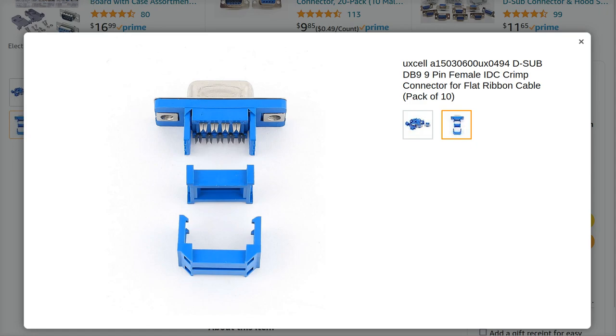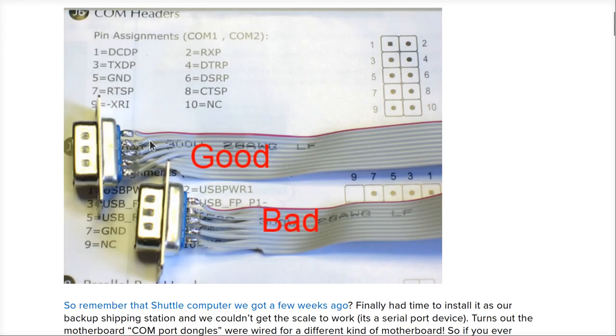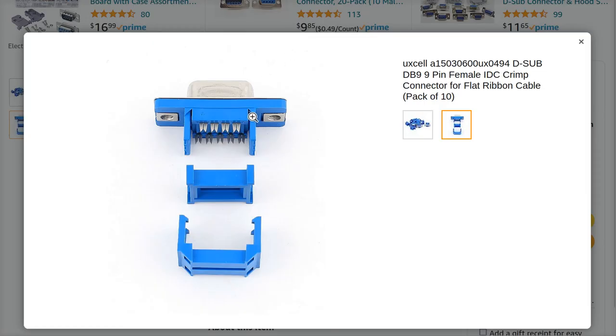Now, having said that, I have in the past taken my ribbon cable and pulled apart all the wires in a ribbon cable, sort of like this, and then carefully and meticulously laid them back down in a different order in order to achieve the, let's use the word creative, choice of the ordering of the wires and then crimp that on. Yes, it will work. But that is how it's prone to error. It's a complete waste of time, utterly pointless. I call that stupid. Okay?